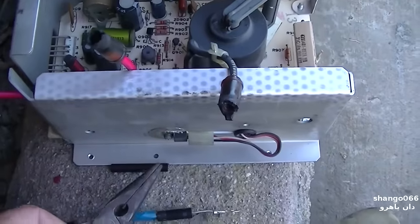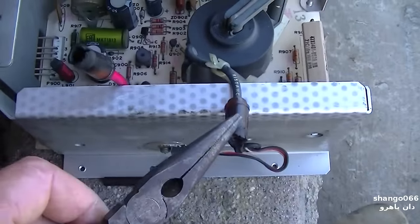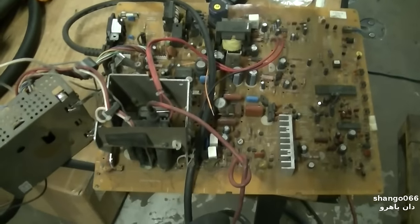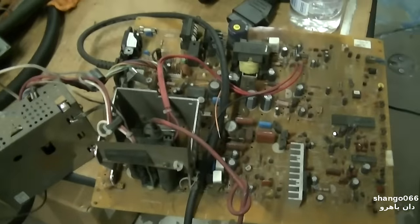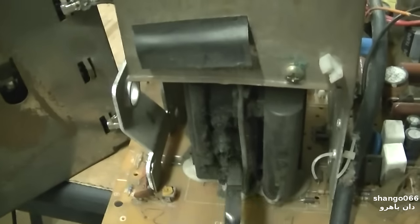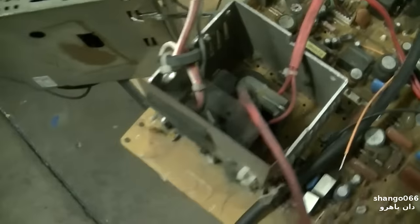If we get high voltage I'll go ahead and order the diode and figure out how to make something like this. The other thing about the TV focus rectifier is those are usually under five kilovolts for the focus voltage, so I don't know if that would work. This is just a scrapped-out chassis out of a monitor. Theoretically we would have good diodes inside the flyback here, but the problem is getting to them - they're all potted in there real good.